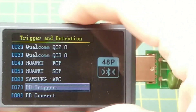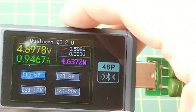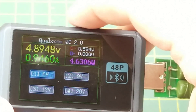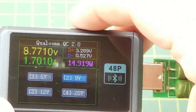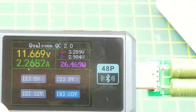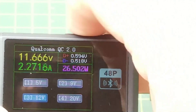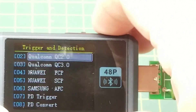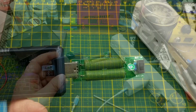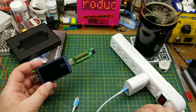Let's see if it'll do QC2 — enter trigger. So we're in a different protocol of power delivery, quick charge. We're calling for nine volts, now five, now nine, now 12 — it can do it — now 20, except it can't do that. I'm going to drop back down to 12, to nine, to five. Not sure if you can see it, but there's little wisps of smoke coming off my resistors, so I'm just going to let it cool off unplugged and we'll look at the manual and some other stuff.